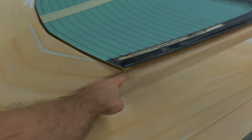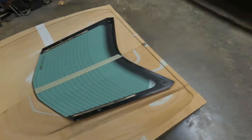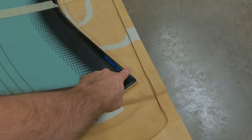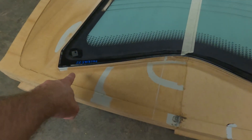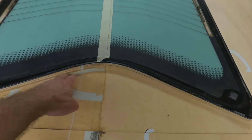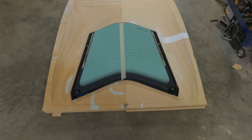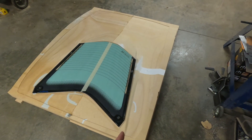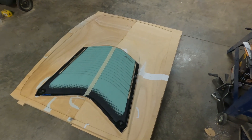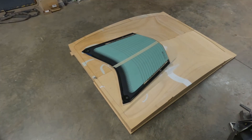In the back, it's a little narrow. You can see the mark of where it needs to be. I can fill this in with Bondo and make it good. It is correct around this edge and over around that edge also — they look good. But you can see where I've drawn a line: I need to remove some material, it's a little too big in this area. I think I can remove that material with a Dremel tool and a drum sander. Then I'll build a dam here and fill in that void area with Bondo and blend it in. It'll take some work, but it's not impossible by any means.